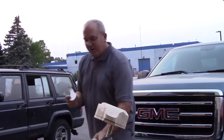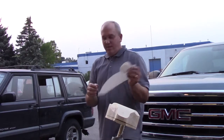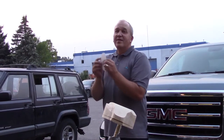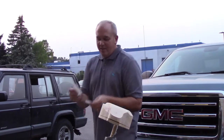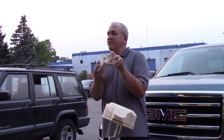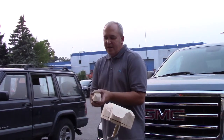And make sure when you're drawing your patterns, the length of this matches the length of this, the side profile. And your front profile needs to be the same width as your top profile. If you don't, you're going to be off. So it's some planning. I'll draw this on the top of the block, and then on the front of the block, I'll draw this.